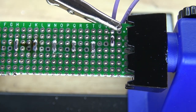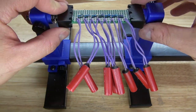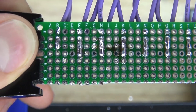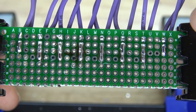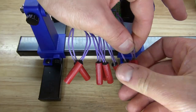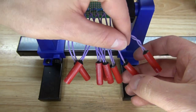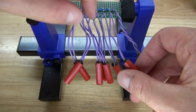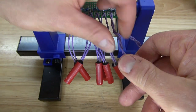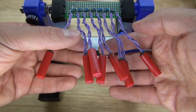As you can see, my mercury tilt switches have one lead connected to the resistors, and the other lead is not connected to anything. That's because I'm going to do a solder bridge where I connect all of those unconnected leads together, so that I can connect them all to VCC, or positive. Next, I'm going to twist all of my mercury tilt switches to make more tension on the wire and to make it spring better. Repeat the same process on all of them. And it should look just like this.